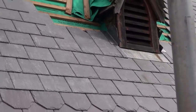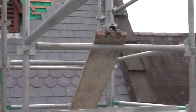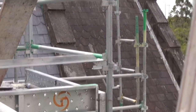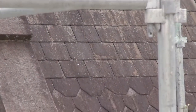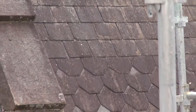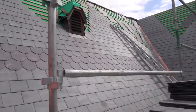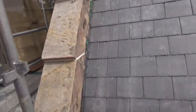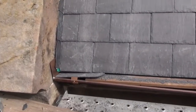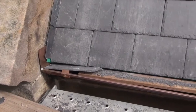To our right hand side you can see what the old roof was like — where it's got the old terracotta ridge capping, the lead flashing, and the slates themselves are a lot thinner than what we use today. So there are quite a few failed slates. What we've also installed here is a new copper guttering and ridge through the middles, so this will be very well watertight.